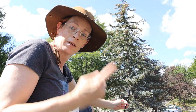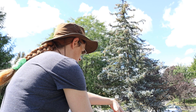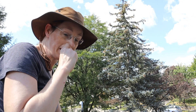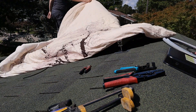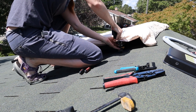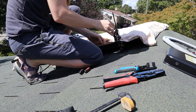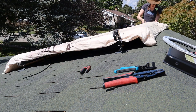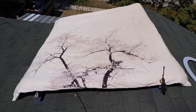Alright, with some proper sun protection — sunscreen and barrel connectors — let's see if my plan of going straight from one end to the other is going to work. I should mention that I know the panels are uncovered, I know they're generating power, and I'm treating this like a live system. I'm going to go get a blanket and also get some heat shrink tubing — the resin-shield stuff for extra waterproofing. I'll be clamping onto the support strap, not onto the panels, and onto the system off switch.